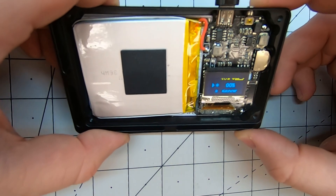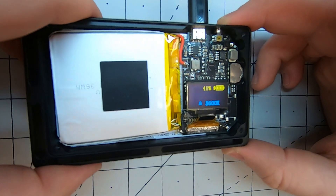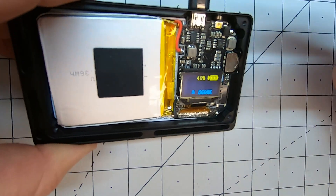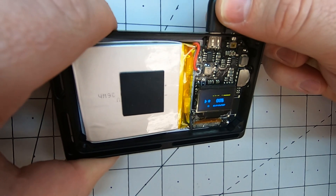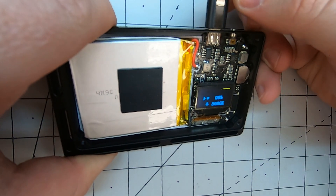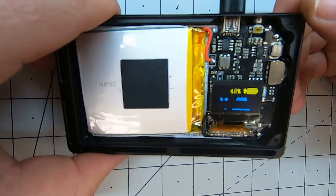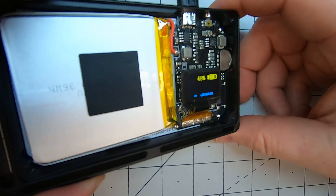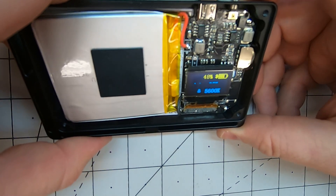You could get that from a bench power supply, or probably three AA batteries with some thin wire would get the voltage in the right range — just for about 30 seconds to give the battery enough voltage that the charger circuitry will say the battery isn't completely dead and give it some charge. I hope it was helpful, and my electronics experience is severely lacking — please tell me about it in the comments.